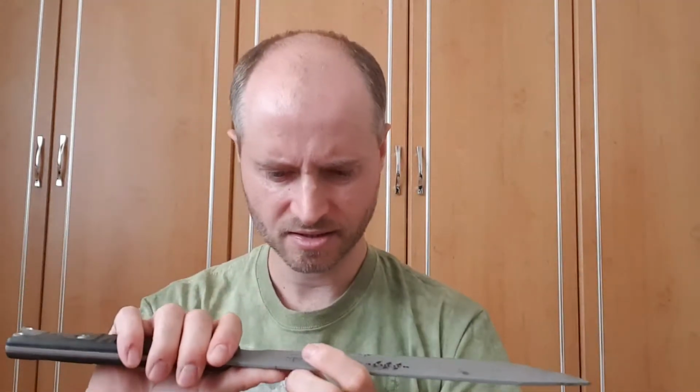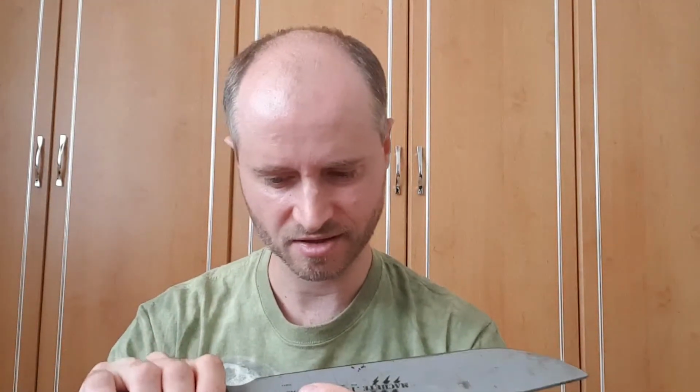But as I said, it is probably a secondary bevel, but not like unusual ones on knives. The angle is not that big, but the second line, which is the definition of the angle before the secondary bevel, is here, more close to the tip, so to the edge. So the angle is much bigger. It's going basically like without the secondary bevel. It's going straight away to the edge, and in this part to the tip also. So the tip is really not sharp.